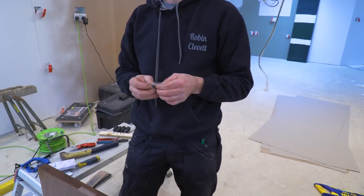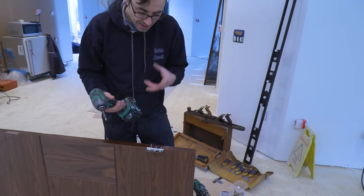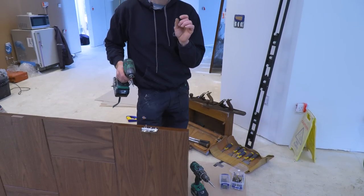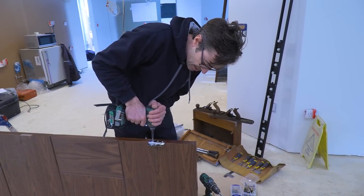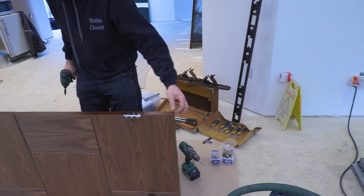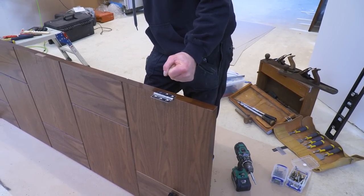The screws are brass screws, chrome plated, and we like to put these in with a screwdriver. If you're going to use an impact driver or electric screwdriver, try to have it on a low setting. Sometimes you can adjust the torque and in this case I've got it on quite a low setting. If the impact driver goes off the pilot hole may not be big enough — the last thing you want is to heat these screws up because they have a tendency just to go ping. Inside this walnut lipping is a core which consists of chipboard. Once you're through that there's around 10 millimetres of solid walnut — you want the screw to bite well into that walnut, you want it to cut in and bite and it's going to stay there forever.